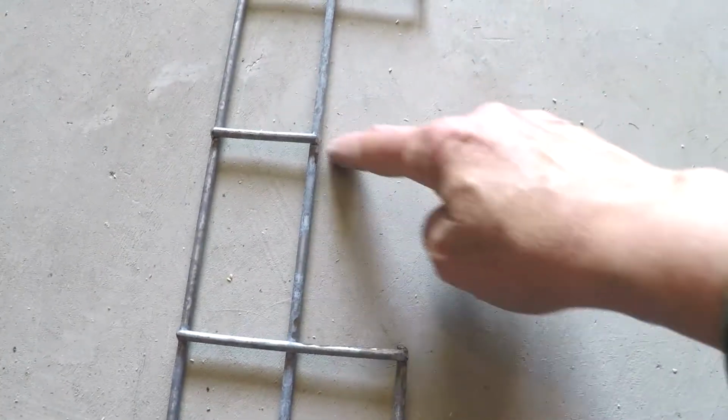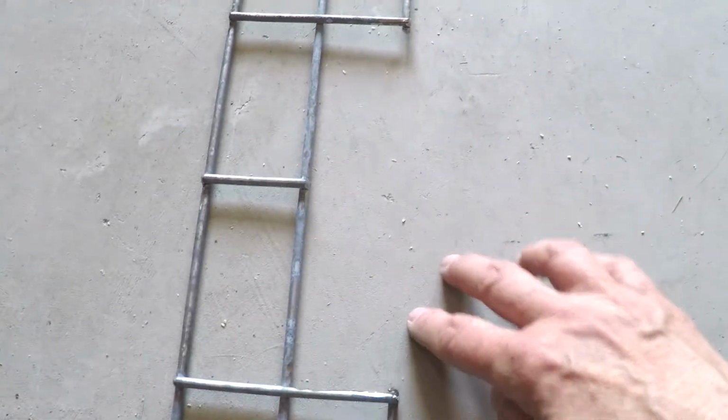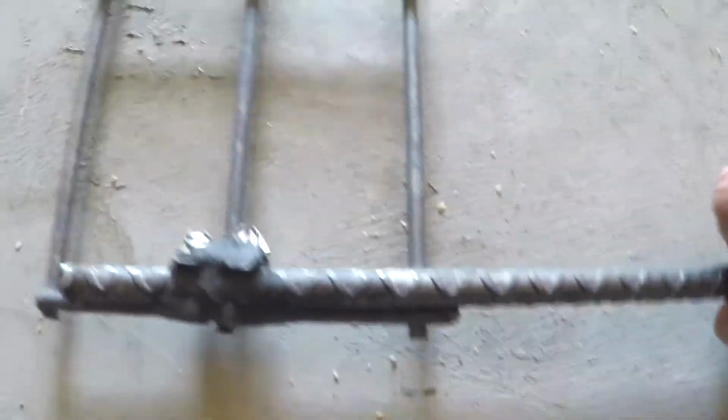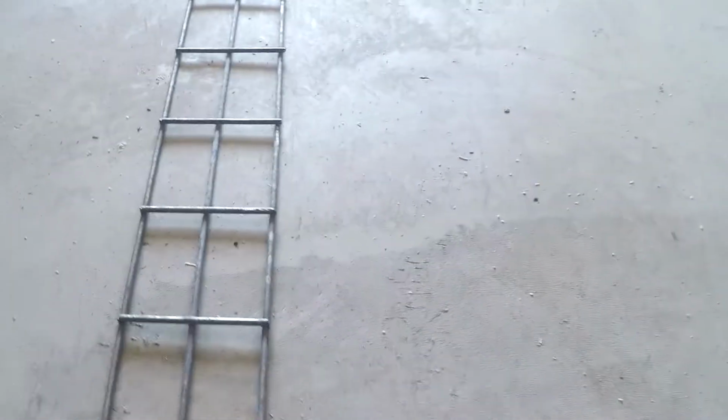So you'll cut this bar, and this bar, and that will allow an insert for the gate spring. So we'll attach a spring here that pulls the gate closed. Then on the bottom, as I showed you before, we've attached this rebar and are holding it on with the hose clamp and the steel stick. The rebar is 34 inches long, just like the width of the panel. And this will give your trap rigidity. You really need this bar, so don't fail to put that on.